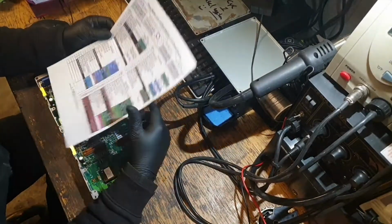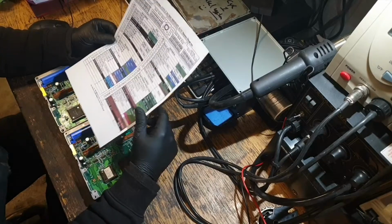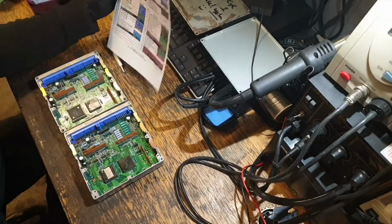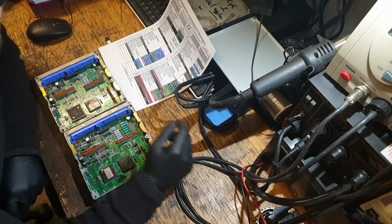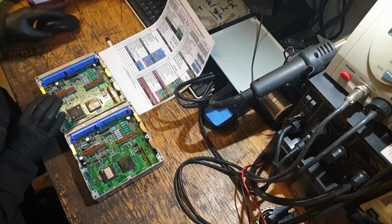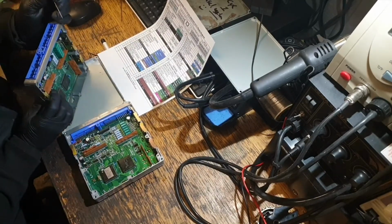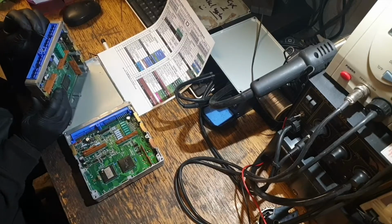So a quick double check of the part number, and it is an RB25 manual transmission R33 ECU. So it's not been mixed up or anything, and I've printed off the pin out for the header. My tablet's at home, so I've gone old school. So now I need to find cylinder 1, he says. Cylinder 1 ignition pin 1. That one there. And compare that to any of the others. So I've got 5 and 3 next to it. Those 3 pins.